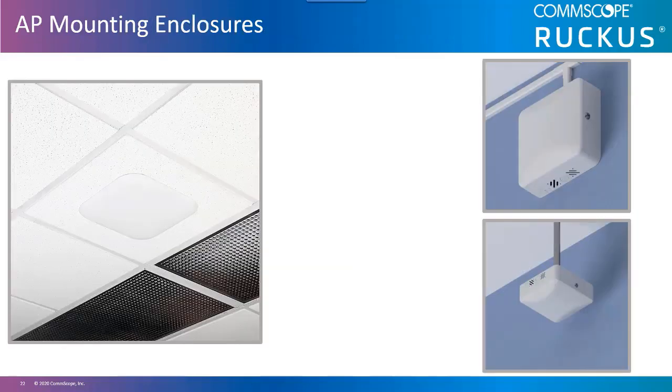Enclosures are used for many purposes and in different environments. They are typically made of plastic, which is transparent to RF signals. It's not uncommon for the APs you mount to require enclosures for security, weather protection, or aesthetics. Flush mount ceiling enclosures are typically used in aesthetically concerned venues such as hospitality, retail, and healthcare to conceal the APs from view. In school environments, a gymnasium may require APs to be protected from accidental impact with athletic equipment. You can find custom mounts that will fit different enterprise quality APs, and you should account for the access point and any external peripherals required.